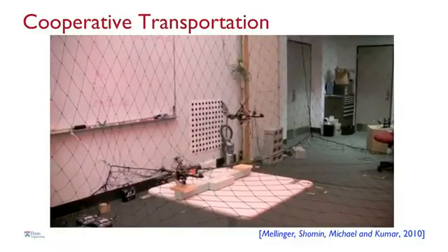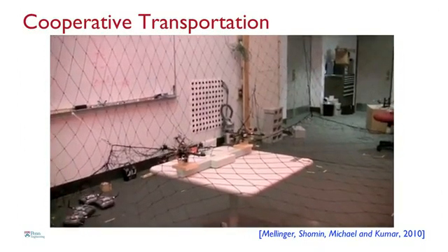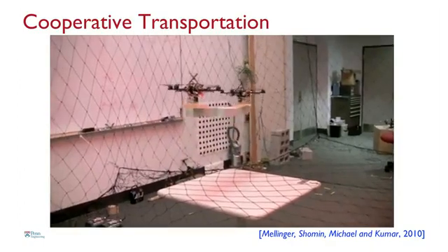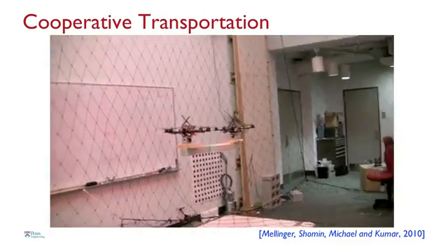Once you know how to fly in formation, you can actually pick up objects cooperatively. This shows that we can double, triple, or quadruple the robot's strength by getting them to team with neighbors. One disadvantage of doing that is as you scale things up, having lots of robots carry the same thing effectively increases inertia — so they're not as agile. But you do gain in payload-carrying capacity.